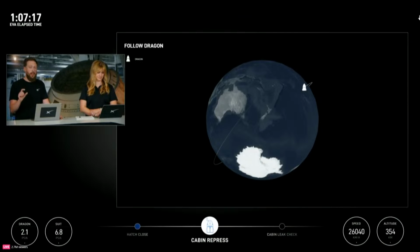And we're also looking at what the partial pressure of oxygen is, because we want to make sure that when the crew takes helmets off and everything, there's plenty of oxygen in the cabin. And then we're going to change that injection rate to just help with the mixing. In microgravity, everything's harder, everything's on hard mode. And you don't just have natural convection.